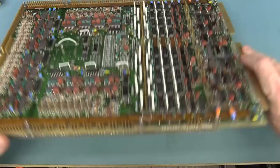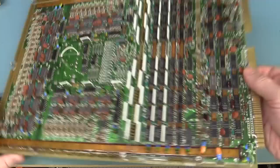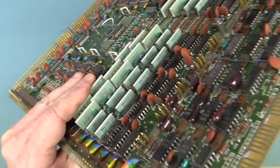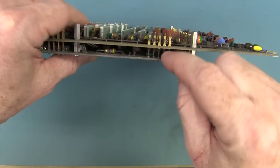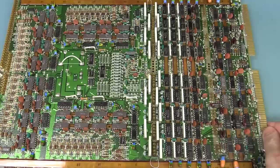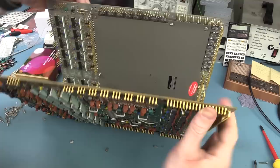And it's a really fascinating board, a mix of technology. Are they resistor arrays they've got there? They're resistor networks, I'm assuming. Interesting mix. You'll notice the turrets, so they've got the pins sticking up, a bit of corrosion on that bottom board, the pins sticking up and then into the turrets mounted on the top board. So that's how they join the two boards together, and absolutely fascinating board. I like this one. And I'll tell you what, this really took some prizing apart. There's a lot of force that goes into that, and ta-da, we're robbed.